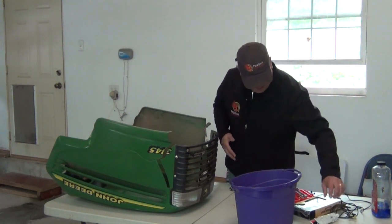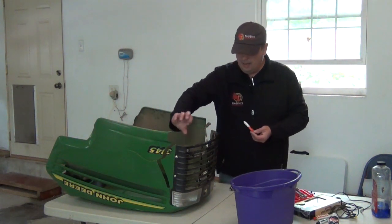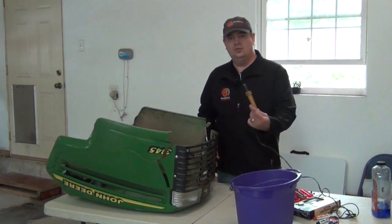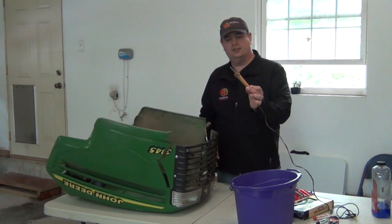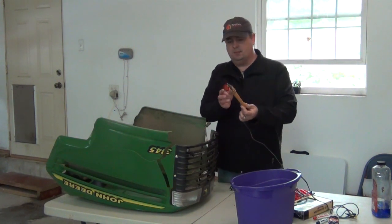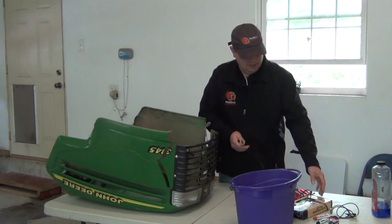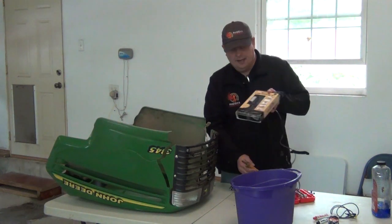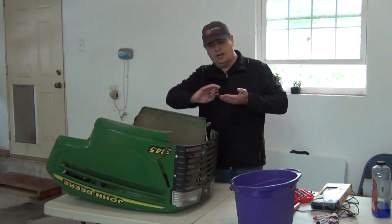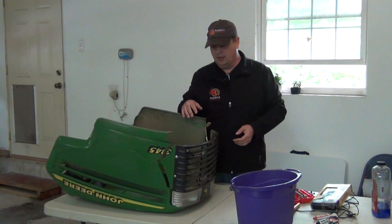What I'm going to do is something a little different. I do have a little JB Weld and some superglue I might use just to hold pieces in place, but what I'm actually doing is using a wood burning kit — which is the same thing as a soldering iron. It gets super hot. I'm going to melt the plastic, weld it together, and form it over. I've got two kits — one with different tip types. I'll probably use a smooth tip to smooth out the folds and give it a prettier look.